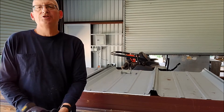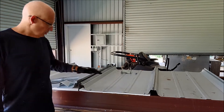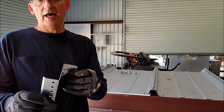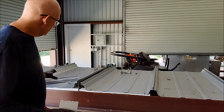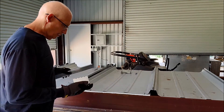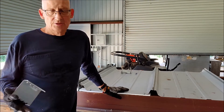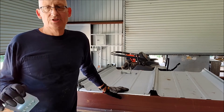We're going to talk about an alternative way to retrofit over an existing standing seam roof, either low-floating or high-floating, using a two-piece system. It's going to be a 16-gauge Z-clip that will sit down in between the ribs of the panel and attach to the purlin, with a one-and-a-half-inch hat section mounted on top of it. The advantage of this system is that it's going to cost a lot less than a notch purlin, and everyone wants to figure out how to reduce the cost of a retrofit — owners and contractors alike.